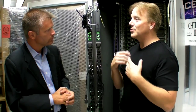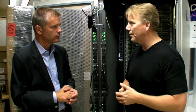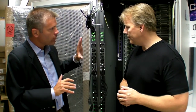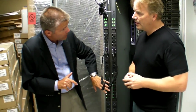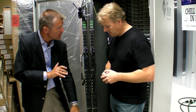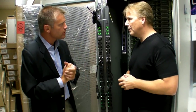You're putting the intelligence in the PDU so we can gather data whether the server is intelligent or not. A full picture of the data center is what we need to make decisions about what's inefficient versus what's very efficient from workload or any other component. Looking at what the Green Grid is saying: if you go all the way to level 3 monitoring for PUE, you need that information right down to the outlet level. Level 3 is the outlet level; level 2 is the actual feed. We also measure readings at the power in-feed level, so this unit complies with Green Grid requirements for accurate PUE. There are over 600 data collection points per PDU — everything from temperature and humidity down to the five measurement factors per outlet times the number of outlets.